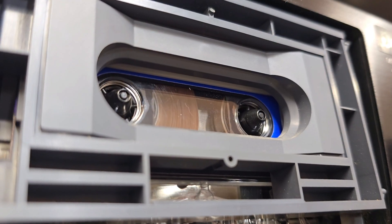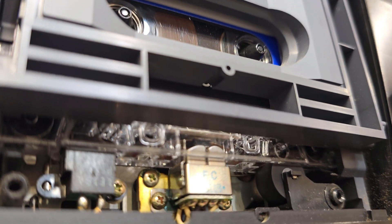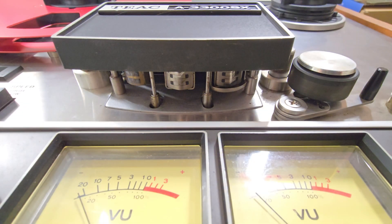For those who aren't familiar with analog music recording, here's a brief explanation as to why we'd even need noise reduction. In a tape recorder, the magnetic tape moves from one reel to the other over a set of heads — one for recording, one for playback, and another for erasing the tape. Some combine the record and playback heads into one. The act of moving that tape over the heads creates noise — that hiss that you hear when listening to a tape.